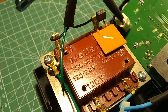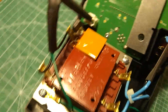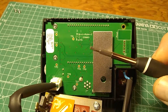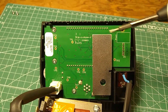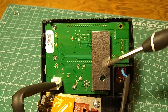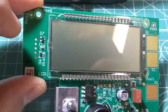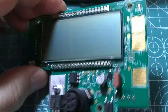Inside the case you'll find the Weller-branded transformer, 23 volts on the secondary, protected with a thermal fuse — this little black fuse here. To remove the printed circuit board from the front panel, use a T8 Torx screwdriver and remove this screw, this one, this one, and this one in the corner. Don't touch the Phillips head screw here as it's only holding the heat sink. This is the circuit board from the inside of the station.